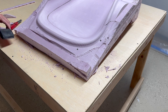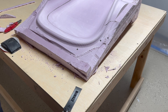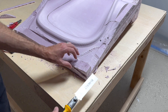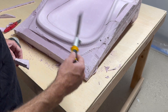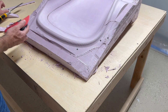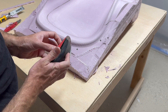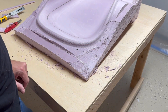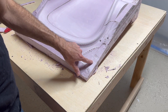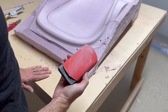Now that I'm into it a little bit, I'll show you what has worked for me. I have this fine-toothed saw — usually meant for cutting dowels flush with a surface — but it worked great for getting rid of all the bulky pieces. I found some sandpaper around and started giving that a shot, and it turned out that worked out pretty well too. You can get a nice, smooth, clean transition once you've gotten the bulk out — you can smooth it all with just some sandpaper.